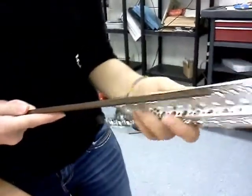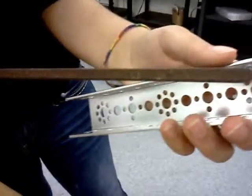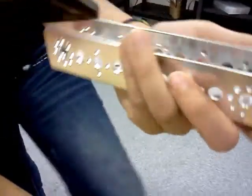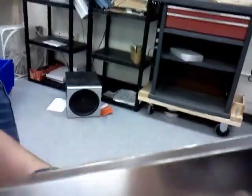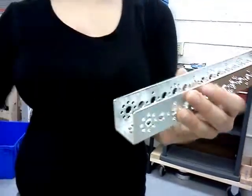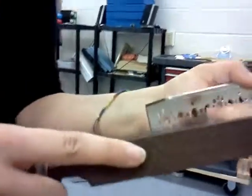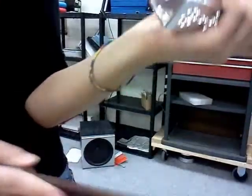To use a file: pretend this edge is kind of jagged and I need to take off an edge — I would just file away at it like that and you can see kind of how it affected it. It just took some chunks out. Also, say if you had a corner that came to a major point, you could take your file and round that off.